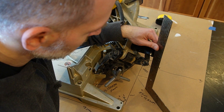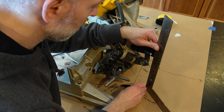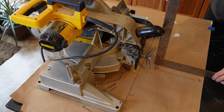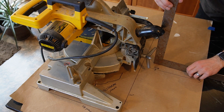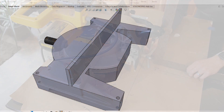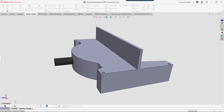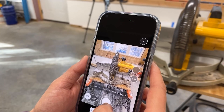To figure out the size and shape of the dust shroud, we need to add a digital representation of the miter saw to our SOLIDWORKS assembly. In the past, I would take measurements of the real-world object using tape measures, rulers, and calipers, and use them to make a very basic model of the object. This approach has always served us well, but this time we want to try our hand at 3D scanning.